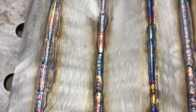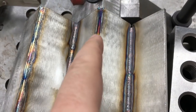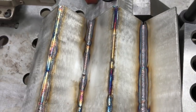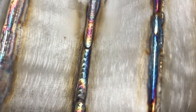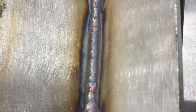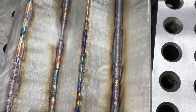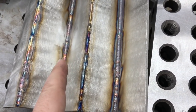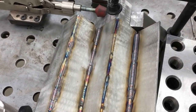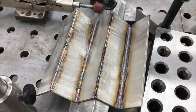We'll wrap up this video — I'm really happy with this section here, all that gold coloring. Not sure if it's just the part heating up or what. You can see big differences based on travel speed. This one down in the joint is pretty good; this one not so good — a lot more heat, you can see the heat-affected zone on that one compared to this one. This one I welded standing upright, this one I welded just as it sits. Anyway, some good progress — happy with that, just got to keep working at it. Alright guys, that's it, we'll see you next video.